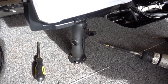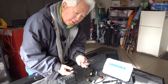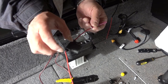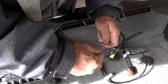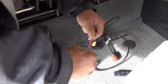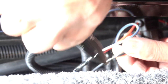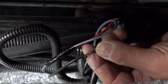It's all secured down so he can watch it while going backwards. Now we're getting power to the unit — all the units come with a fuse and fuse holder. Most fish finders use a five-amp automotive fuse. Put it in, close the lid, hook the line to the fuse — that'll be the positive, this will be the negative — give it 12 volts and we're ready to rock.